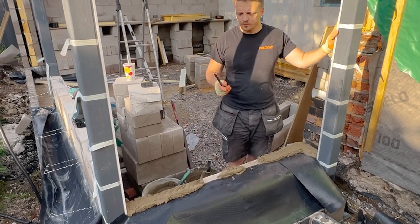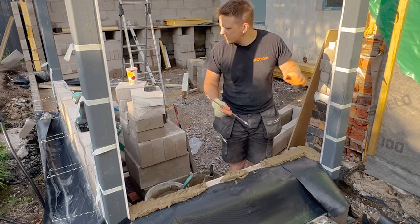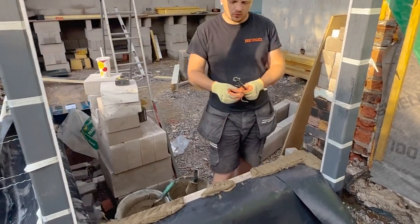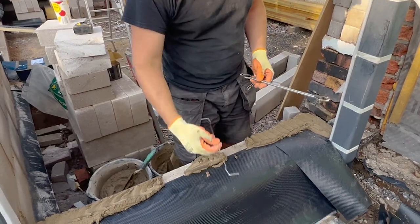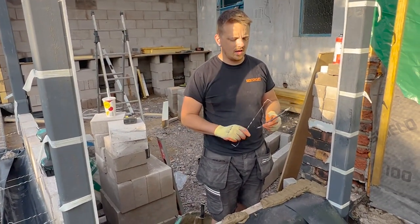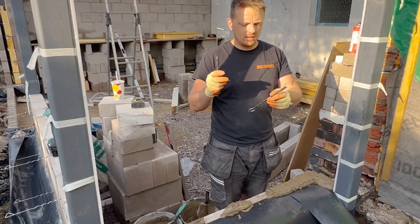Right guys, so we were waiting for the building inspector to come originally to tell us if we could use a stretched out cable wall tie to go across there, but he said that wouldn't suffice. We'd need to source 350mm wall ties, which I have, stainless steel. They're a bit different to obviously the wired ones.